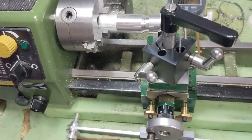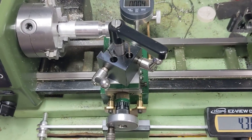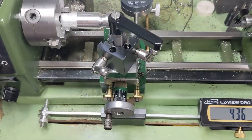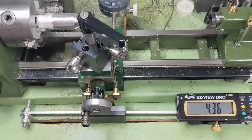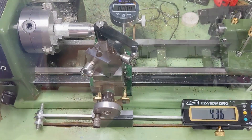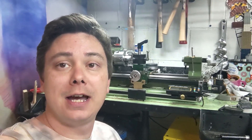There is a little bit of flex in this system — I lose about five thousandths of an inch when changing directions — but it's very functional. If you're used to being precise on manual equipment, you're also used to accounting for backlash in your systems. That wasn't really the full build video I had promised, but I wanted to get this quick addendum in for people who wanted to know how I mounted these scales, or how they might mount them to their own lathe. That's all I've got for you today — thanks for watching.